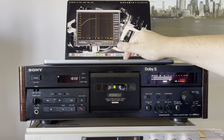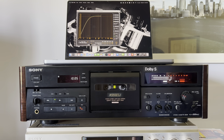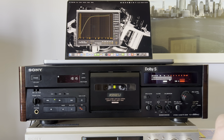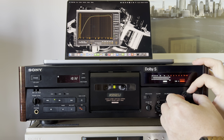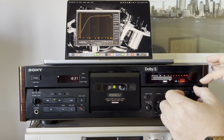I'll extend the scale so it's easier to read — one square will equal one decibel. You can see there's a small bump of about one decibel around 10 to 16 kHz, and I notice the left and right channels are a little uneven. Let me try to adjust — I need to add more on the right channel to make them even.